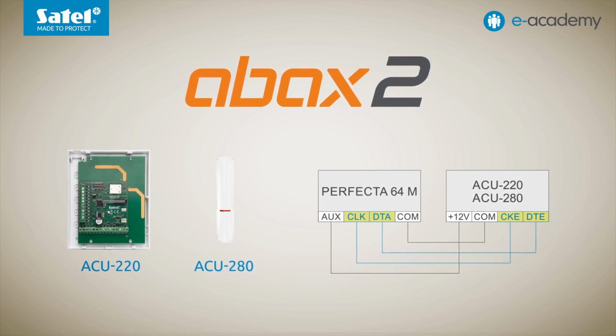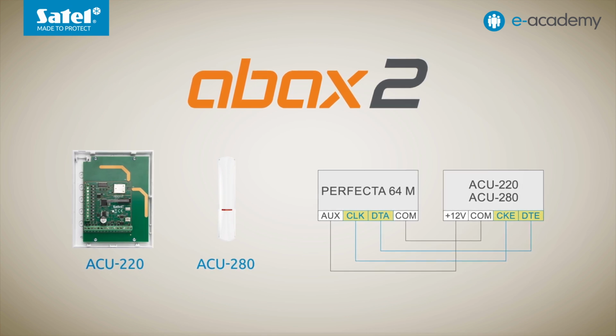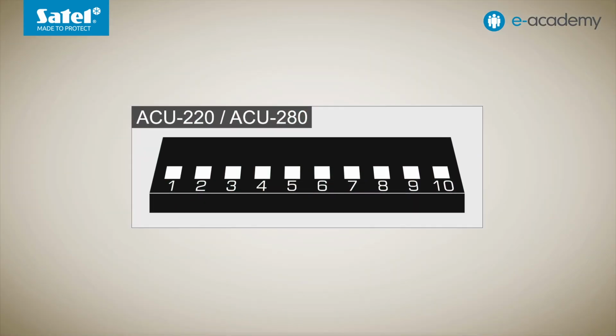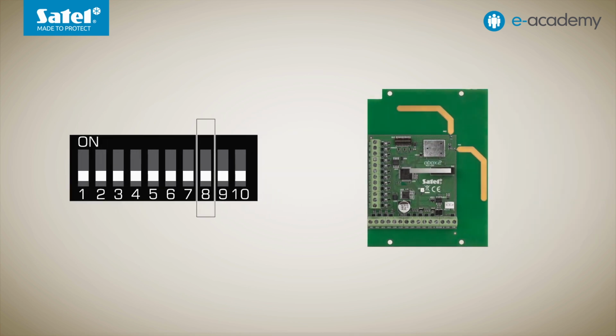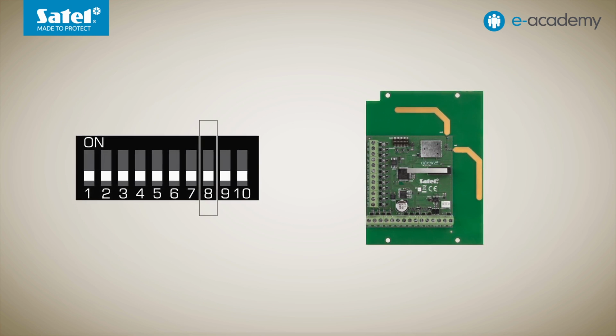Let me start by reminding you that ABAX 2 controllers are connected directly to the bus of the PERFECTA 64M control panel. In addition, a set of dip switches must first be found in the module to be connected. When using the control panel being discussed, switch number 10 should be set to the on position, and switch number 8 on the ACU 220 module we are using in this episode is for selecting one of the two transmitting antennas. The switch should be set so that the polarization of the module's antenna matches the polarization of the antennas in the other devices operating in the system.